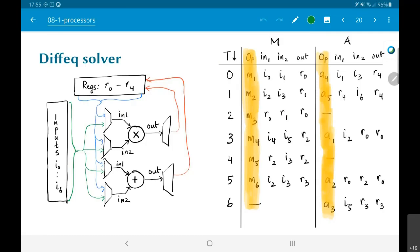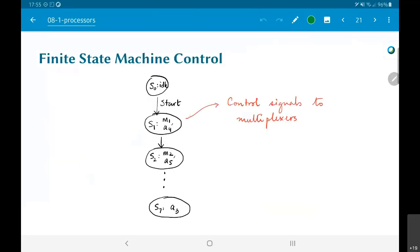If my multiplier is slow, I could allow multiple clock cycles for it to operate. Right now that is not the case — I have drawn a schedule where in clock cycle number zero, marked by t, m1 is scheduled and also finishes within the same clock cycle. Similarly, in clock cycle number one, m2 is scheduled and finishes, a5 is scheduled and finishes, and so on.